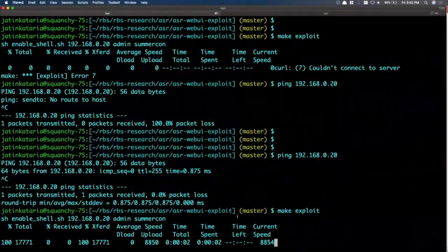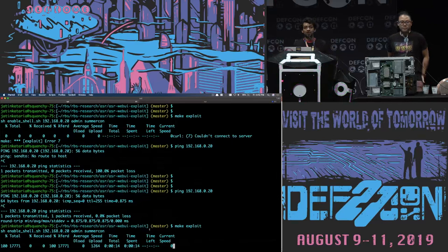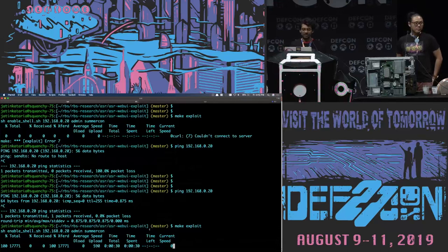So what it is doing right now is James's hack, getting root, and then we took a driver, which was crack.ko. I don't know why they wanted to crack it. But we hijacked the driver. We reverse engineered the CPLD driver, understood how the FPGA emulates the SPI flash for the Linux OS, and then applied the patch. You only require around 15 bytes of patch to disable the complete update and also disable the reset.